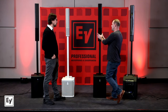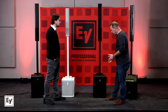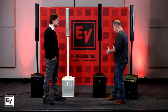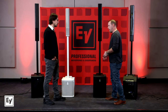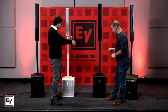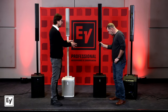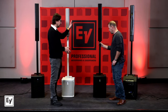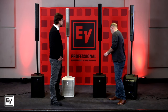That's obviously a lot of thought, and that's why it sounds so good. The 12-inch sub — nice and compact — adds a real punchy sound. With all these drivers, tell me about the amplifier. All the wiring is internal going back to a single 1000-watt Class D amplifier, powering both the subwoofer and the tops, splitting the power between them.